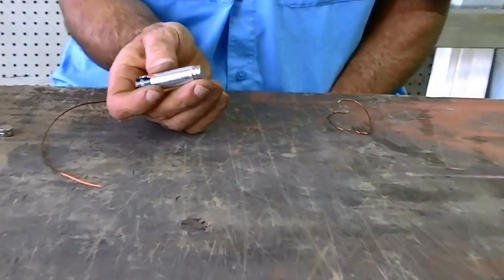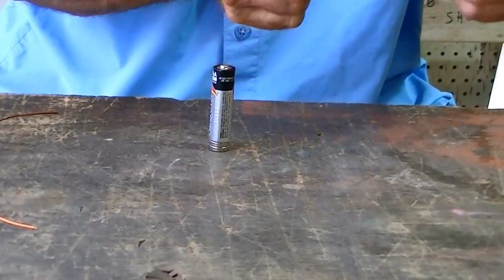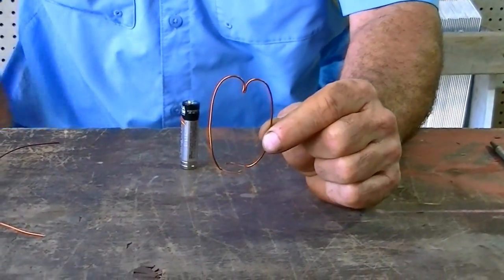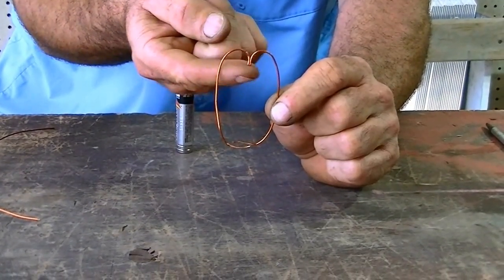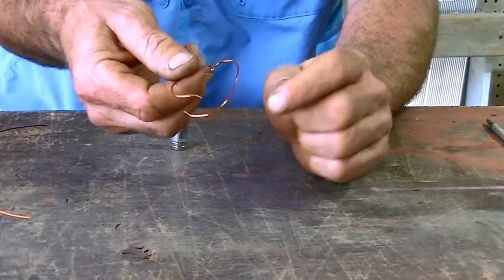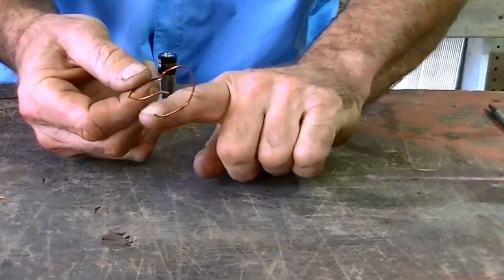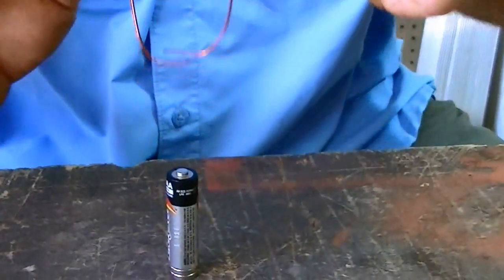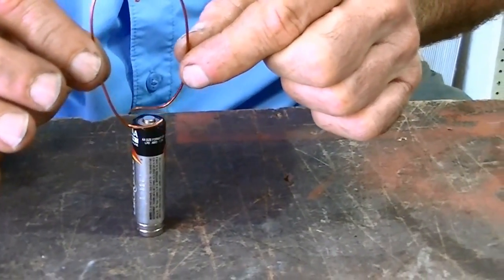Put the magnets on the negative side of the battery and you'll bend a number 18 gauge wire, kind of heart shaped. On the bottom here, you've got to scrape off the enamel and also scrape off the enamel on the ends and bend it — it's kind of a half round shape. You've really got to spend some time tinkering and getting it just right so that it doesn't squeeze too hard and won't turn.